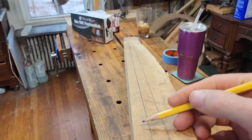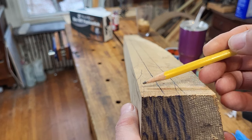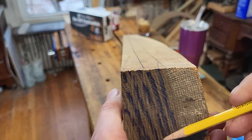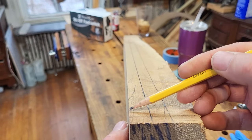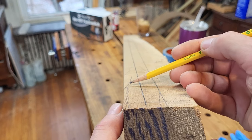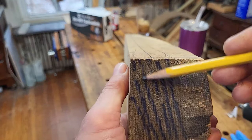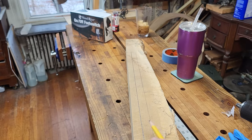Because what it does is, if you shape this like this, okay, this line that comes out right here where it's broken right there, because of the taper, the bottom of the taper ends up in here somewhere where it's complete all the way along. So you only have a small section of it that's being cut off. Where if it was straight up and down, this one grain line that runs like that, where you shaped off, it would be a straight joint all the way down right there and can break right off. So that's another reason why you want it somewhat in a rift-sawn configuration, angled to the straight line, and then fairly straight grained, which this piece is.